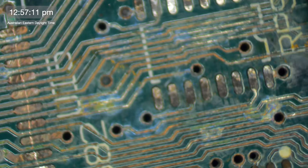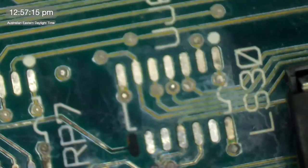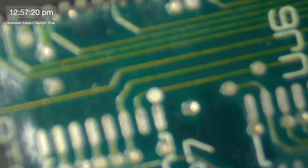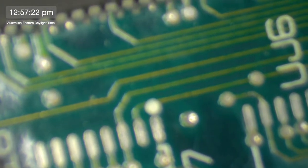How many parts do you think it will take to replace this? Well, I've got the crystal I already have. So that's the clock crystal. The real-time clock I already have. Two diodes I already have. The caps, of course. I've got 1, 2, 3 F258, I've already got them. RP4, RP8, RP9, RP7. They all need to be replaced. The floating point unit needs to be replaced, and this LS30.